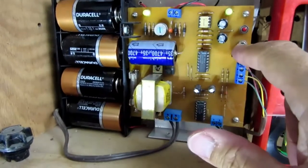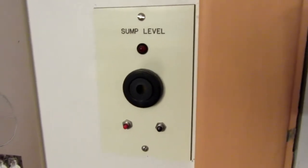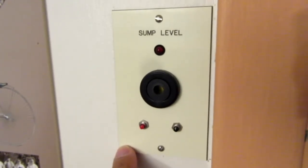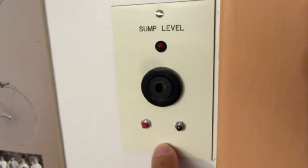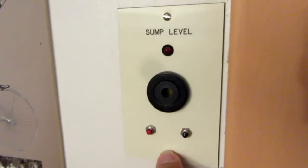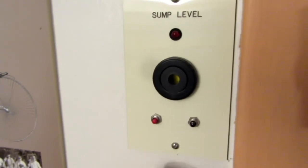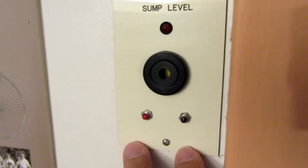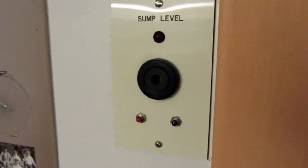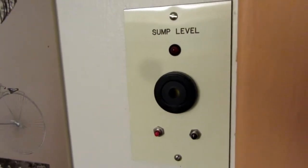This is just an AC power indicator and this is the alarm indicator. So this is one of my two remote panels for the system I just described. It's the size of a normal plate for a switch or outlet. Since I have access to an engraving machine, I just engraved a piece of plastic with a black core like you'd use for industrial name plates — but you could just as easily use a regular switch plate with a label. It's pretty self-explanatory. It doesn't even have a box behind it because it's all low-voltage wiring, and the wire is tucked behind a door frame. This one is in the entryway of my house, so when I'm walking through the door coming back from out of town I can tell if there's a problem.